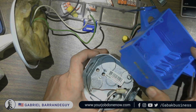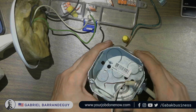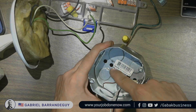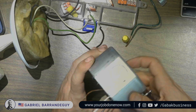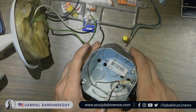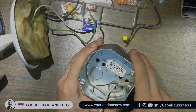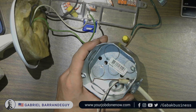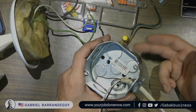If you have a metal one — let's say you are hanging a ceiling fan or putting this in a basement — you will see that we have a few holes here. If you put a long screw here you can mount it and hang almost anything from this box; it's not going anywhere. It's going to hold a lot of weight, so always check the rating of the box — it will tell you how much weight it can hold.